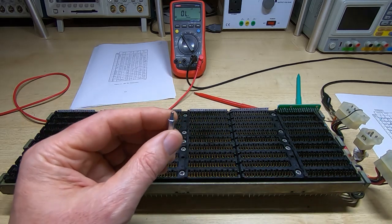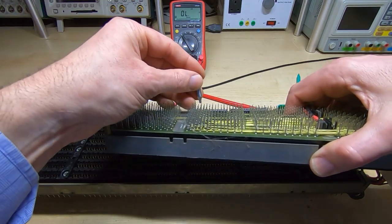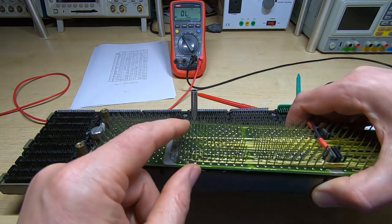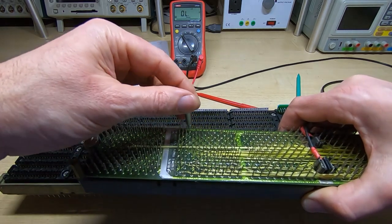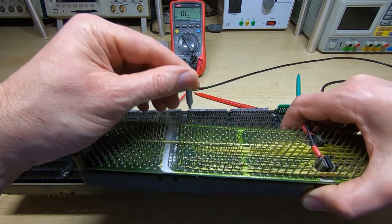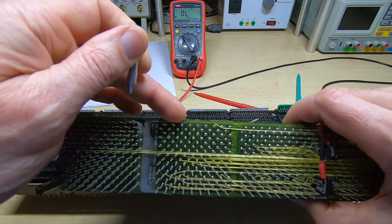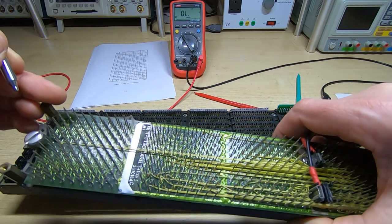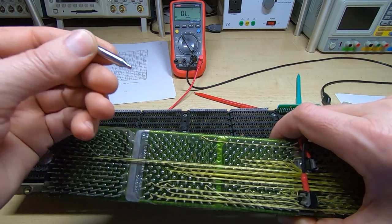What I do is drill out the tip, and I've got another backplane here to demonstrate — I drill the tip and then it slides over the pin. It's a kind of tight fit on the pin that will heat up just that pin and that particular solder joint, and then I can feed solder down into the joint. It gives you very good heating of just that pin and allows you to get quite a good solder joint. I can't remove the old solder, but as long as you use a bit of flux in there it does seem to retake reasonably well. If the pin looks badly corroded I clean it up first as best I can and then try soldering it.